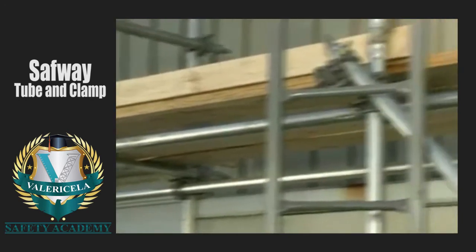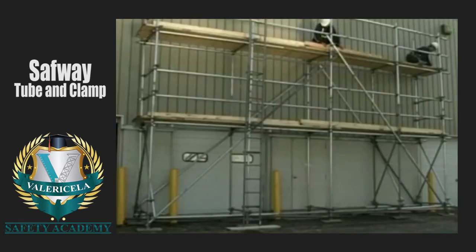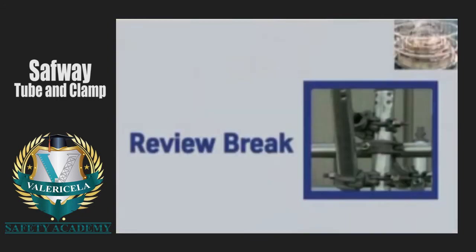If tools, materials, or equipment will be piled higher than the toe board, screening must be installed from the toe board or platform to the top guardrail. A canopy or catch platform may also be erected to protect employees below.